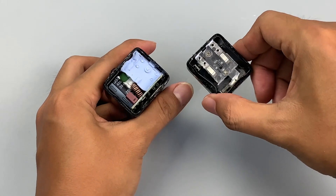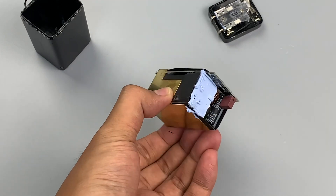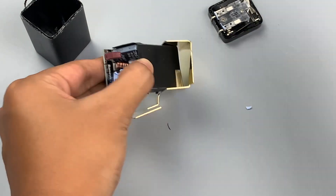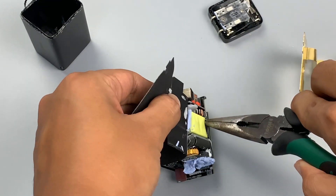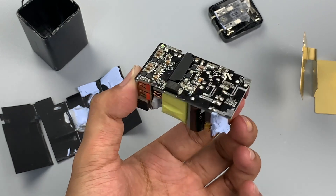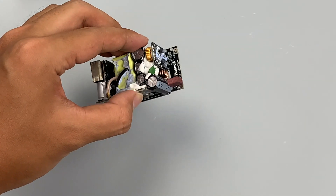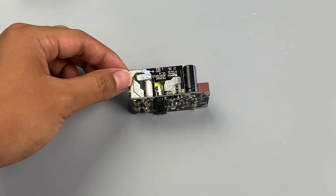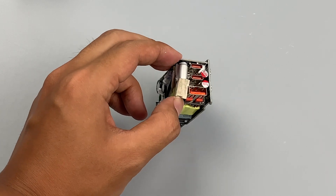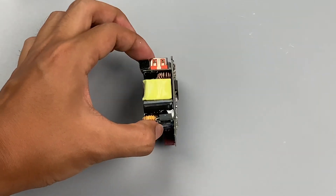Opening the shell and taking out the internal module, we can see a large area of copper heat sink covering it to dissipate heat. The input of the PCB is covered with thermal adhesive. Removing the insulation plates and heat sinks reveals capacitors, inductors, and transformers from the front. This module consists of multiple PCBs, which improves space utilization and achieves higher density. There are two rectified bridges on the small PCB at the input end, and the PCB on the side crosses the primary and secondary circuits, controlling the entire module. Three ports are soldered on the same small PCB, and there is a conductive fabric above the USB-A.